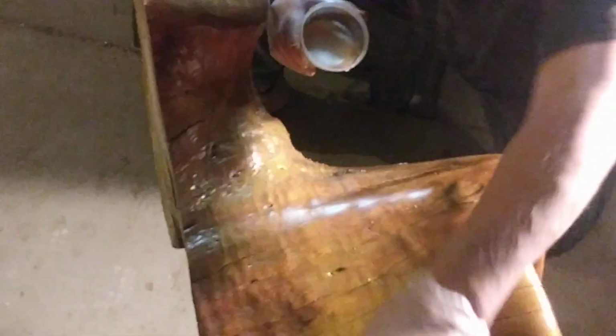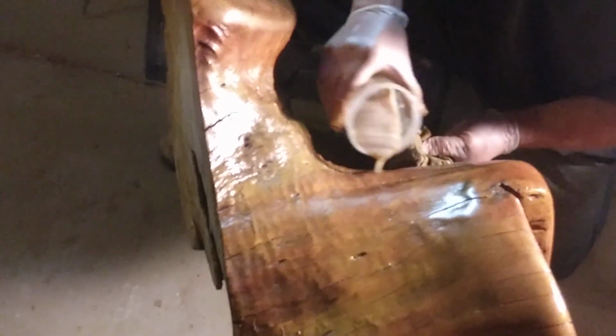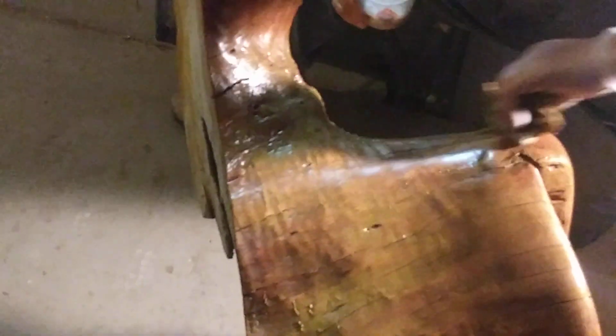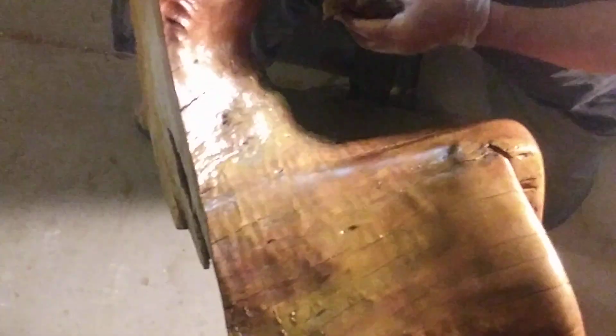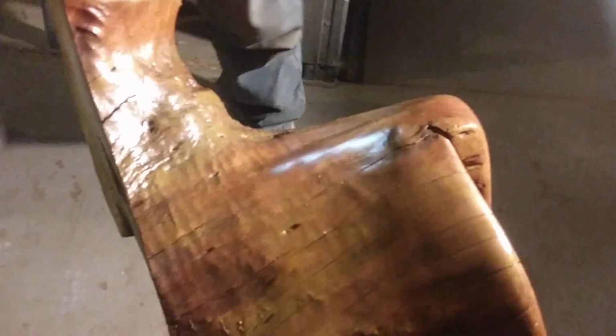Now I'm going to get this back edge in here. Next, I'm going to get this side right here first. And feather this out. Now if this was hot, you'd have to be moving really fast because it would want to dry. And you want to remove any hard lines. You want to feather all your hard lines out. Always. Even if you're painting, same thing. Alright? If you get a hard line into it, you take a razor blade backwards. Okay, scrape it backwards with the razor blade.